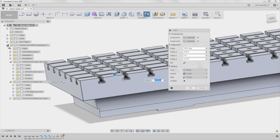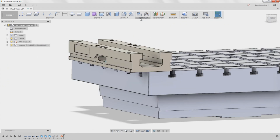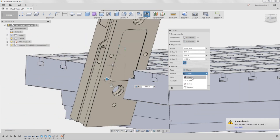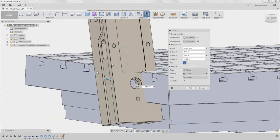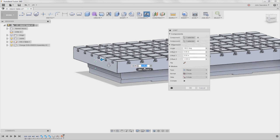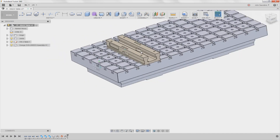I can't see it yet, but if I hide my mill table you can see it's there. When I click OK it should pop. Assemble joint, planar — I think I had to switch Z versus X. Planar along there, not flipped — I want it upright. And right now I want to move it over negative 9.375. Click OK — boom. I'm not going to defend that as being intuitive, but sometimes you've got to do stuff to make it work, and that seems to be correct.